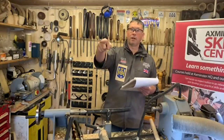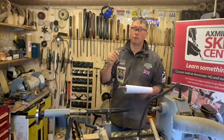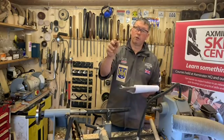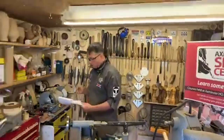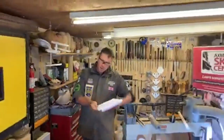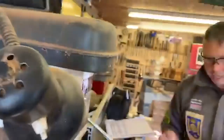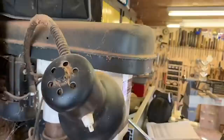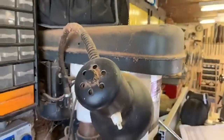We're going to look at the Excalibur adjustable bits, because you were asking what cutters we have at 42mm that could hold a tea light. So let's have a quick look at that, and then we're going to do one more question from Lee, and then we're going to call it, otherwise I'll be going over time. So TCT cutters, we do a Forstner series 42mm. But if you didn't want to go for that one, then the adjustable one.